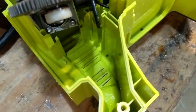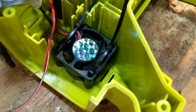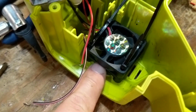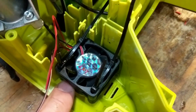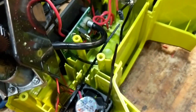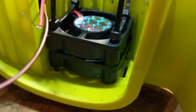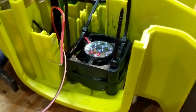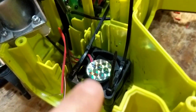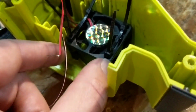I've just started setting this up for fans. I have zip-tied into place a couple of 12-volt fans that are back to back, wired them in series so that makes them a 24-volt need. This is 18 volts, so that actually powers them nicely. I spaced them with little rubber washers so that's something you could certainly do, or get a 24-volt fan that would work in that space. It fits pretty nicely.